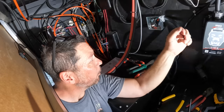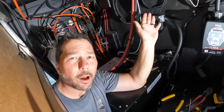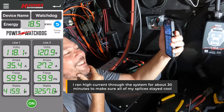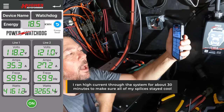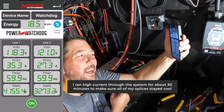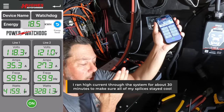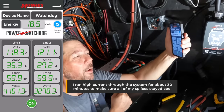Got power applied, going through the junction box. I'm monitoring power — 27 amps going through line two and 35 through line one. About 27 amps on each line is for charging; we're down to about 50% because I've been running off the inverter all day while working on this wiring.